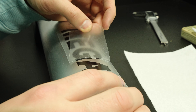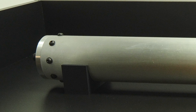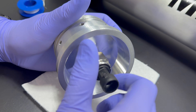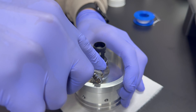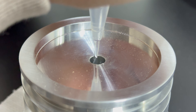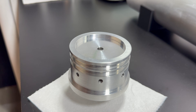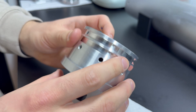The last step before full assembly is adding the Mega X vinyl sticker. Now it's time to actually assemble this rocket motor. I start at the forward end of the motor. Before I install the bulkhead, I need to thread in the pressure transducer — this will give me pressure data inside of the motor during the burn. Once the transducer was fully threaded, I pack grease in it. This helps prevent the hot gases from directly hitting the pressure transducer and damaging it during the burn.